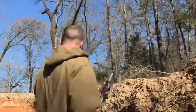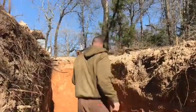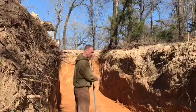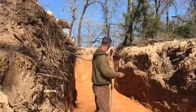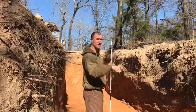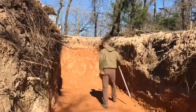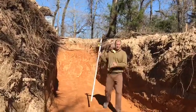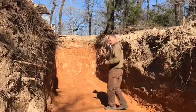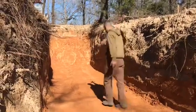You establish your grade at one spot, then go to the high spot at the other end and establish your grade there. My intention is that the grade is going to slope downward as I come closer this way, so I'm going to establish the grade up at the high end and see how many inches per foot the grade drops as I come in. That's the purpose of what I'm doing right here — I'll show you how it's done.